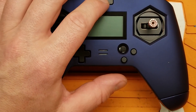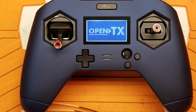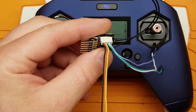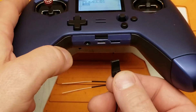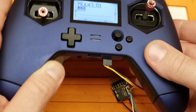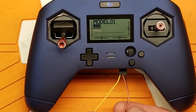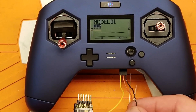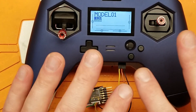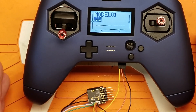Back at the bench. Let's fire up the X-Lite Pro and connect the cable from the RX4R to the port on the underside. The pin out on the underside should be smart port, power, and ground. Make sure you have these right - they should come set up properly, but just in case, some FrSky receivers don't handle reverse voltage well and tend to die.